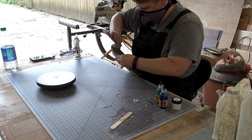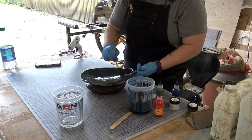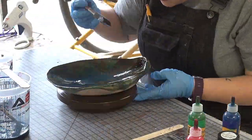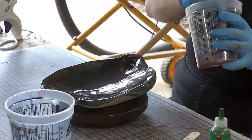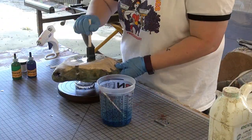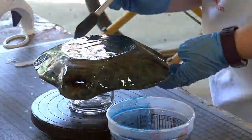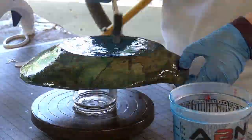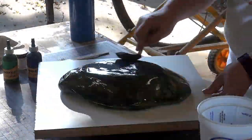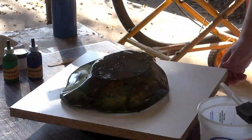They have another one called UV epoxy, which is much thinner and it has a quicker cure time than this one does. Anyways, I used their tints and their metallic powders that I mixed into the Ecopoxy to get various colors, and I did it in layers so you can see everything pull through on the finished product. I did thin layers each time, letting it cure in between each layer, and doing slight sanding with 220 grit to get any imperfections out. And then I used a torch to remove any bubbles during the work.